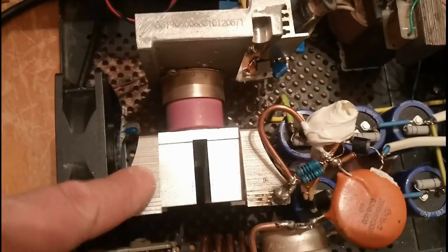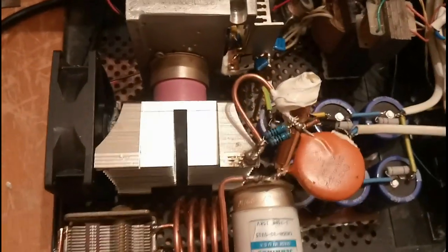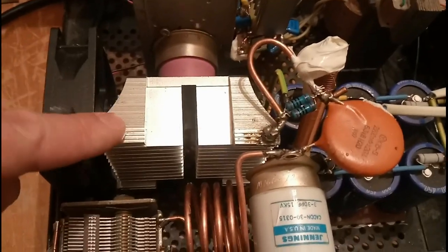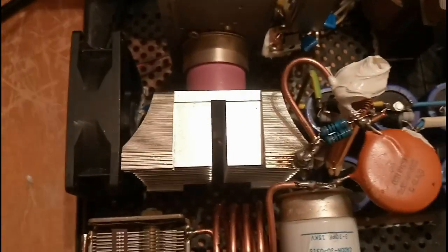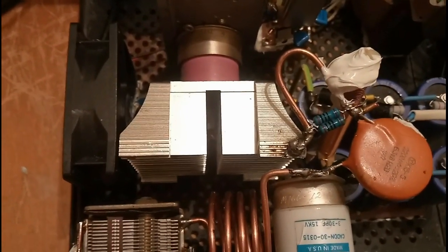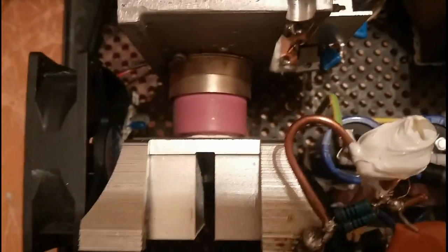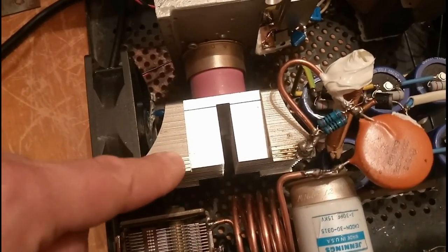The tube, you can see it here, it's a GI-7B with a replaced cooler — it's a PC cooler having a copper pill in the middle, so the heat transfer is very good. The cooling system is only one PC cooler; it doesn't require anything more, because the original aluminum cooler is very good.